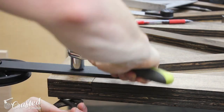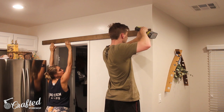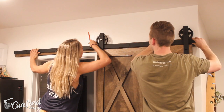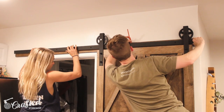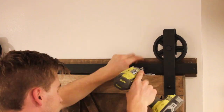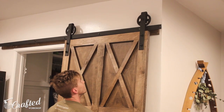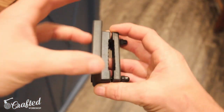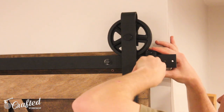To hang the doors, I'm using what I think is called a cleat, which is just another 3-inch strip of hardwood plywood that I had stained the same color as the door. To install the rail, we put the barn door up on a three-quarter inch sheet of plywood and then marked the area where the door would hang on the wheels. Once all five bolts were anchored to the wall, we could put the door on the track. The door kit came with these awesome little stops on each side that could be adjusted to sit wherever you want, so you could perfectly control the overall travel of the door.